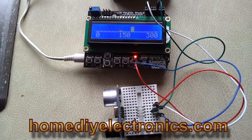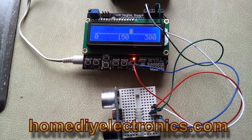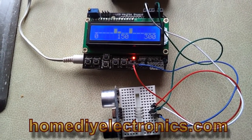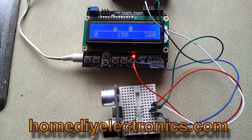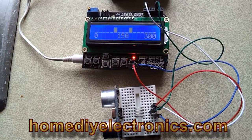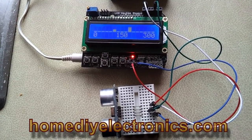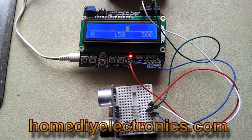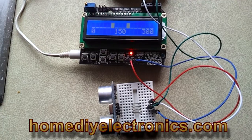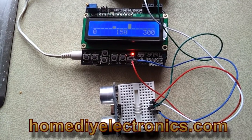When I started to look at ultrasonic rangefinding, I started off by looking at every individual distance that it gave me. And I soon found that that was very difficult to make sense of, because the sensor sometimes has trouble locking on to any individual object. What we're looking at here is the sensor looking at a small object at about 120 centimetres away with the wall behind it. You can see that most of the time it's looking at the wall, which is about 2 metres away, but occasionally it picks up the object.